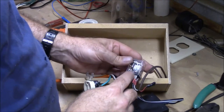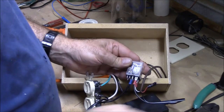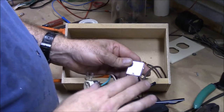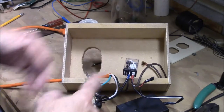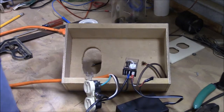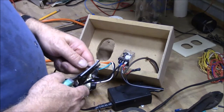I'm coming in here and I want to come out on this one right here, because that one will give me the normally open — meaning when it energizes the coil, it'll close that connection and send power over here. So now I need a piece of wire to do that with. I've found a piece of wire.